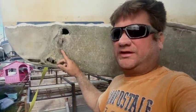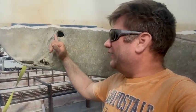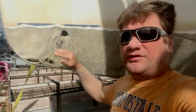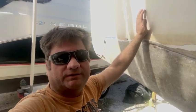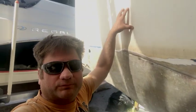Here's another hole — this is the crash compartment. No big deal. This was a repair from a previous owner. I could keep it but it's not really doing anything, so I'm going to cut this back to some good glass, get rid of the poor repair job, and do the same thing — put some starboard in there and start building it out. I can't access this crash compartment yet. This crash compartment comes to about here and it's designed so if you hit something and water comes in, it's contained.